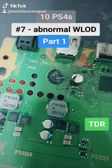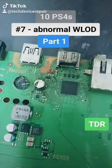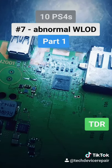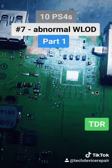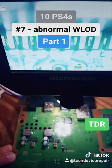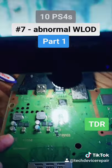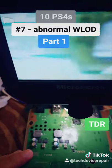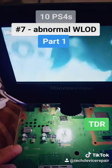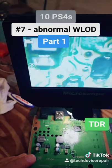What a complete moron — look how everything is destroyed right here trying to take off an HDMI port. This is disgusting. I removed everything that looked physically bad, then took the multimeter and tested all the components. Quick rundown on what we did: we replaced the HDMI port, filters, capacitors on the side, the HDMI chip, and the diodes.